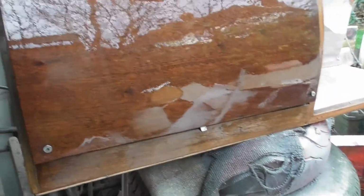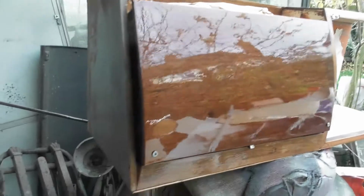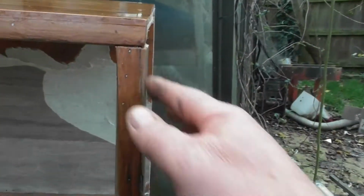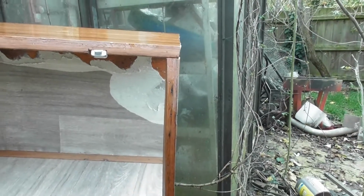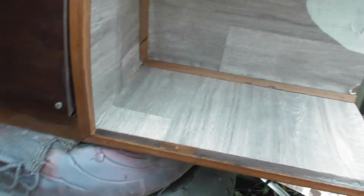We'll remove that door, we'll take the dryer unit, the fan, out at some point, and then that will lighten that up. We'll get the bulkheads in. When we've got the bulkheads in, we'll offer this in place. I've just got a little bit more sanding to do. I've got to take that lip off there, possibly. That sticks out a bit too far. And then once that's up and in place, we'll lacquer up some trim and run some trim in there with some screws, and then we'll line all of that with plywood. That'll be for the cutlery.